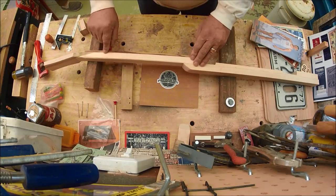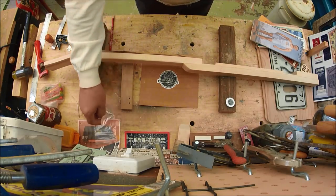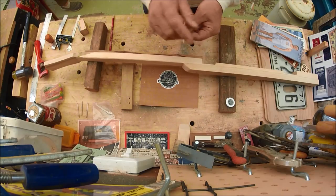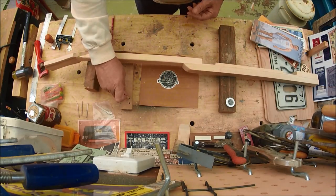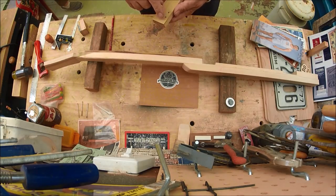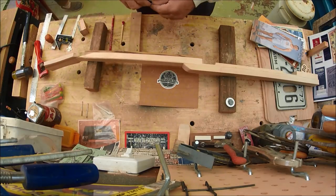Now, what would we use for fret markers? Well, let me give you a couple hints on things that are pretty cheap. First off, you might think about using golf tees. You simply cut the end of this off like so, get it flat. You find out what hole size you need. Now, get in the habit of having a piece of wood that has your different drill bit sizes so you know this drill bit holds the golf tee snugly. This drill bit holds a nail.